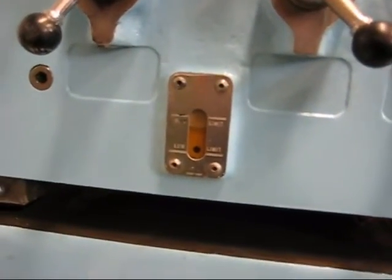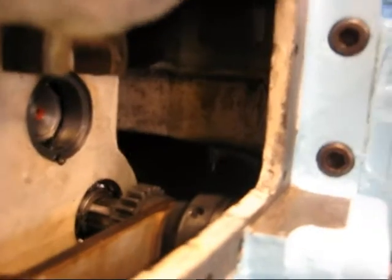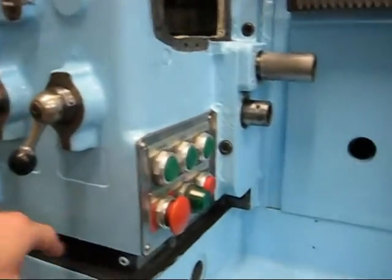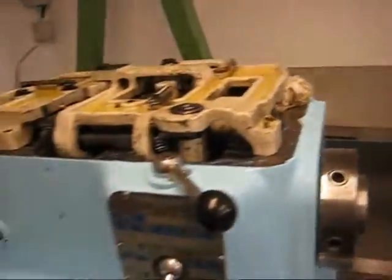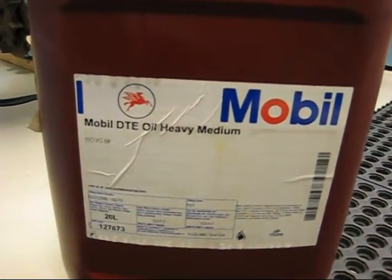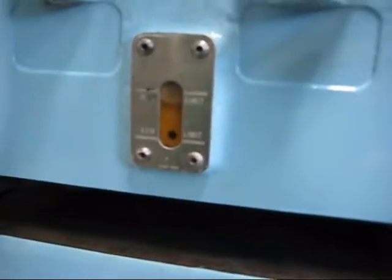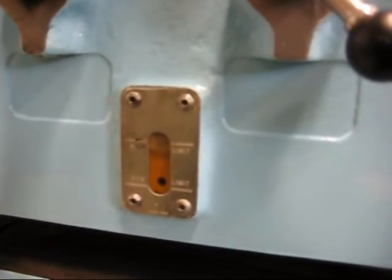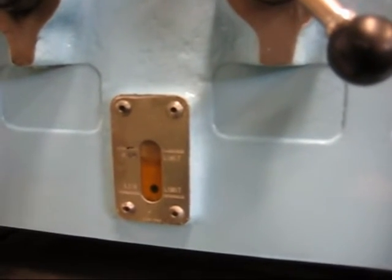I got oil on the gauge here. You can maybe see it — the oil is dripping down from the main gearbox into the oil reservoir at the bottom of the quick change gearbox. I'll put in another gallon or so of new oil. The oil I'm using is the usual for old lathes: Mobil DTE Heavy Medium turbine oil. I think this will be almost full when all the oil has run down into the reservoir. It might go down a little bit after I start it up, because there are some places that will fill up with oil.